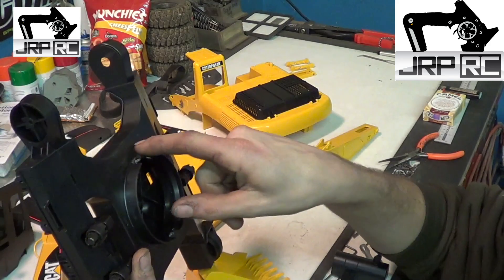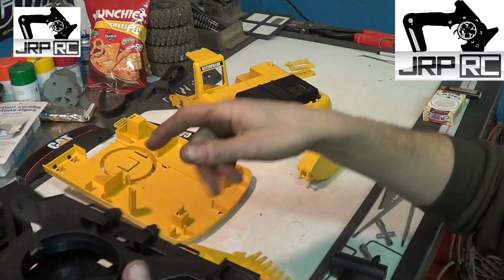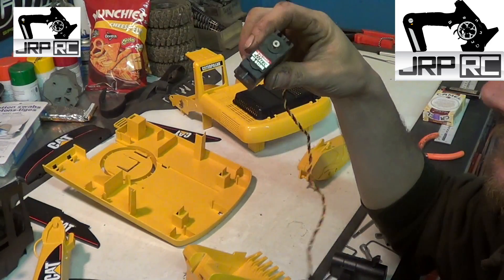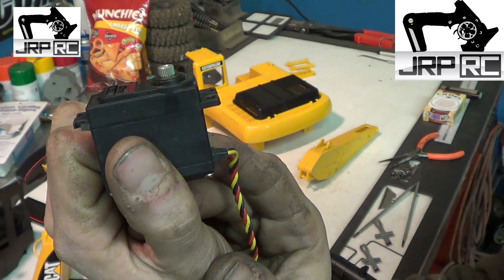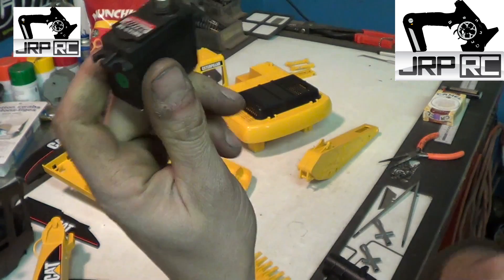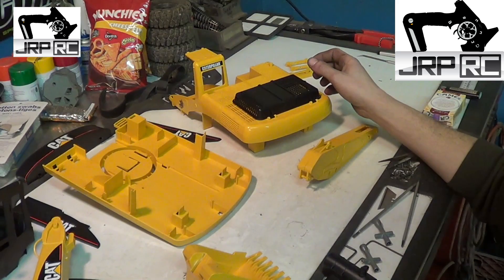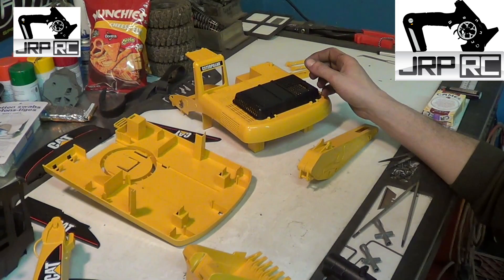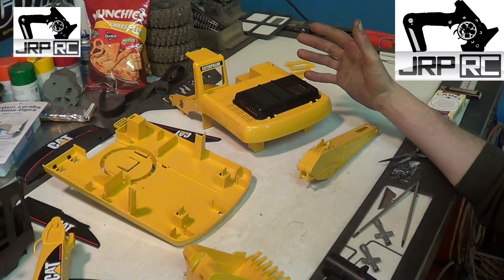I've got to order a gear that'll fit around the outside of this — I'll glue it on good and solid so it'll have a pivot. The only thing I haven't figured out yet is how I'm going to mount a gear to the servo horn. I'll probably end up getting a gear, drilling it out so it slides over this, and putting in a set screw through it. This build will also feature the all-new Firgelli linear actuators, the new L16-Rs. I can't wait to get it all put together and make some videos for you guys — please like and subscribe, and there will be many more build videos to come.